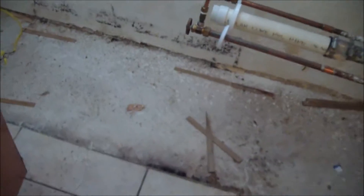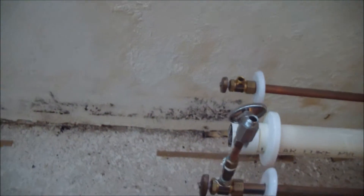This is the cabinet right to the left side of the oven — you can see the mold damage growing right through the plywood. This is right where the sink was; you can see the discoloration all over the wall. And check out the back of the sink vanity — it's just terrible. You would never have known that unless you looked at it. So this definitely was not dried properly and stayed significantly wet.